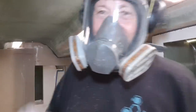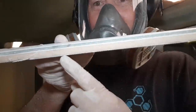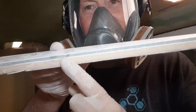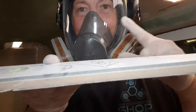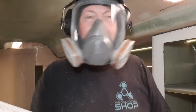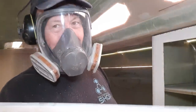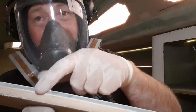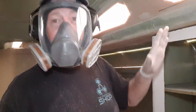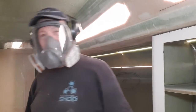Here's a little highlight — just the window mullions alone. I want you to have a look at the cross section. You can see that's the outer layer and that's the inner layer, and this is the window insert — see how thick they are. They get thicker because as I went out to the outside of the insert I put about six layers of 600 double bias over and above what's there. So these window inserts are structural as well as cosmetic.